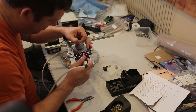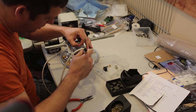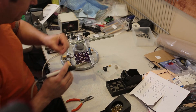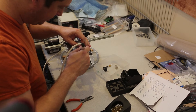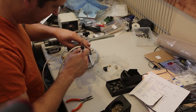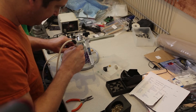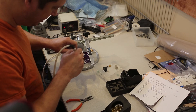Now I'll start in on the ICs and I'm going to do the processor first. I take the bent pins and sort of pick them up and hold them in place, then work my way across the other pins. I'm running my soldering iron a little bit hot because I really need to clean the tip and don't have any tip cleaner, so it's important that I move quickly. That's okay because when I'm assembling these I quite frankly want to get through it. I've managed to cut this process almost in half with this technique. This may not suit someone who is just starting out in assembly or who doesn't do assembly very often.